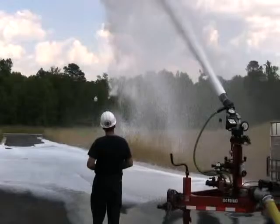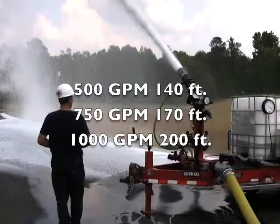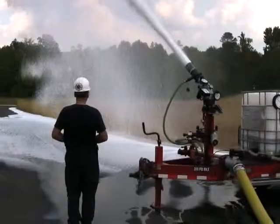The gladiator nozzle aerates the foam as it comes out. This is a built-in aerator. From a point of safety, the operator can dismount the trailer and operate this nozzle from as far as six, maybe 700 feet away from a place of safety, particularly if he's running out of breathing air. It's a good idea to be able to dismount this thing and stay safe.